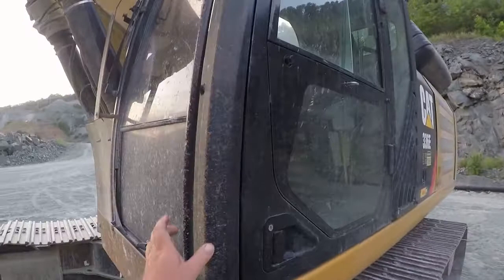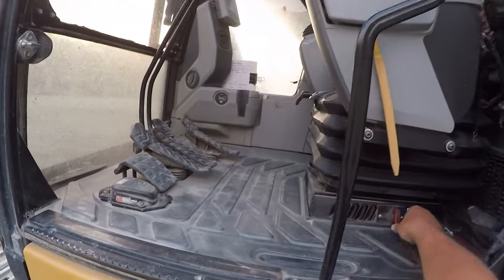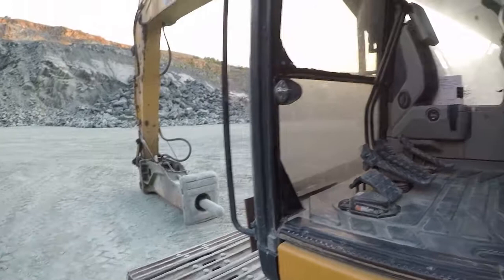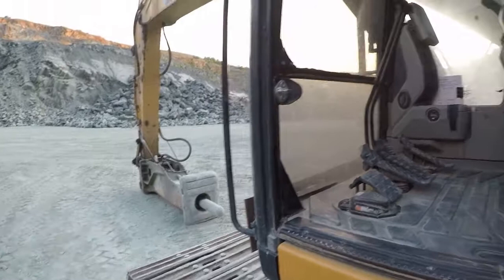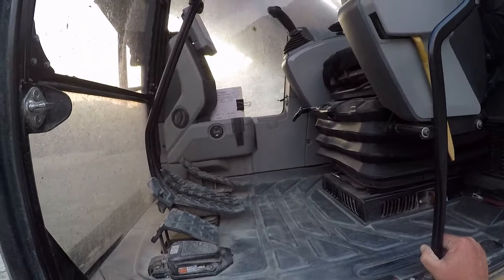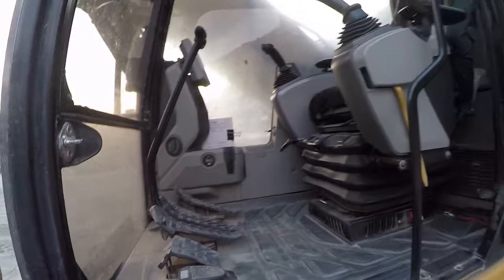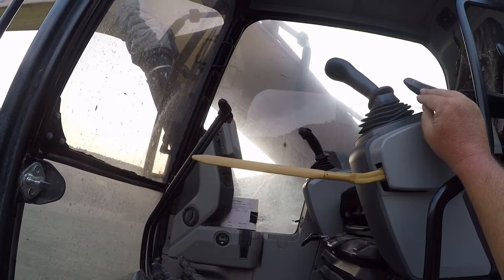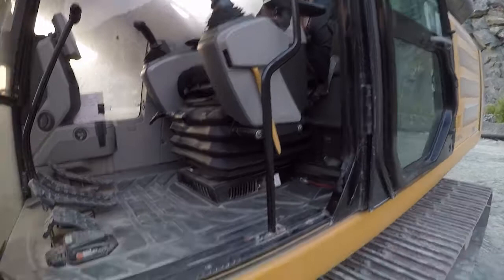Some of the functions that go on here: you have an emergency stop and start. The stop is here in case you're on the ground and need to shut the machine off and can't make it up top. We also have your forward and reverse pedals. Forward, in the direction where your idlers are pointing; if you're on the opposite end, you go the opposite way of your pedals because you're facing the opposite direction. As we climb up, you also have your safety lockout, which prevents the machine from moving on you while you're getting up to the seat.